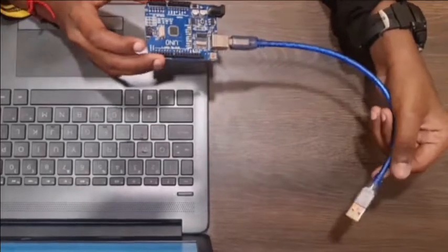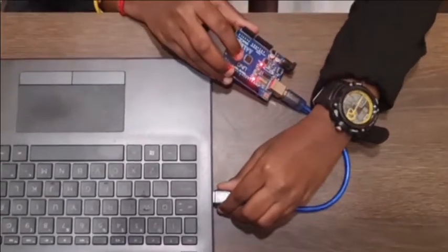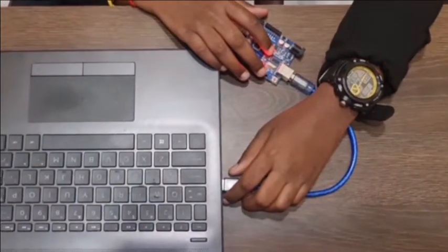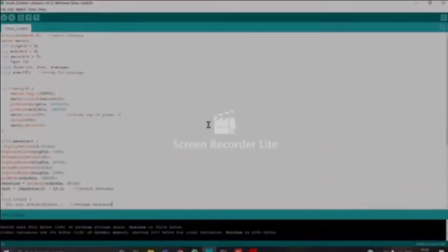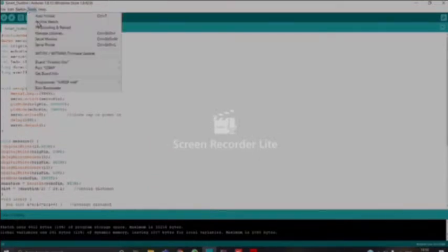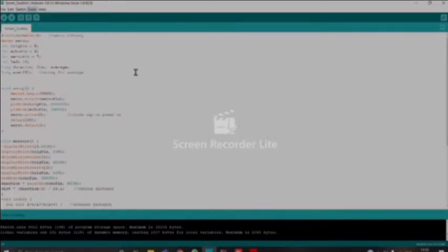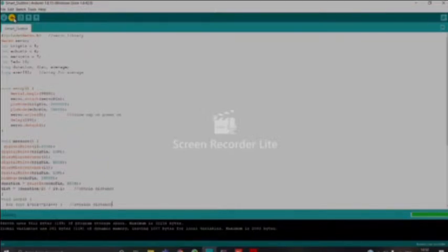Now it's time to upload the code to the Arduino Uno. First, open Arduino IDE, then copy paste the code from the link in the description, then select your port, then upload your code. It is done uploading.